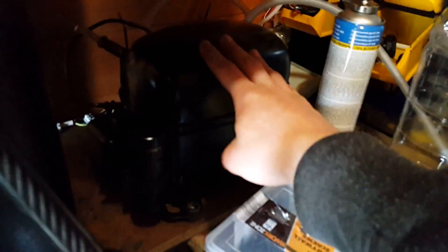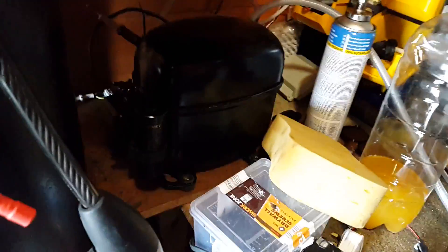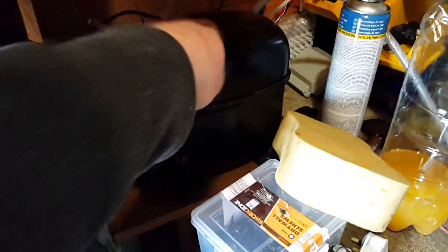This is my most powerful refrigeration compressor — three quarters of a horsepower. I cannot use it though, because to get ideal performance out of it you're really going to need an evaporator which uses 8mm copper tubing and a condenser using 6mm copper tubing, and that's going to involve buying a lot more. Plus this compressor needs to be fan cooled too, so it's not really suitable.